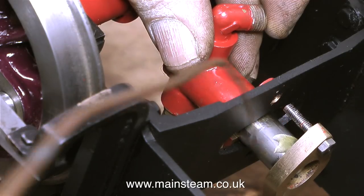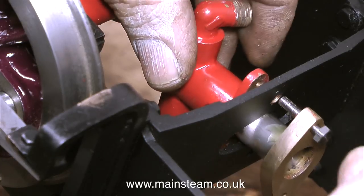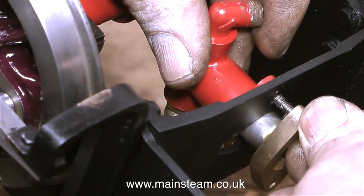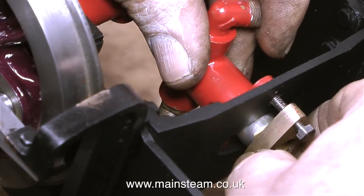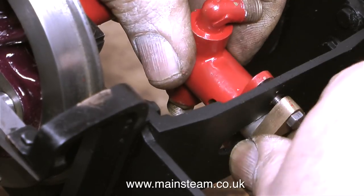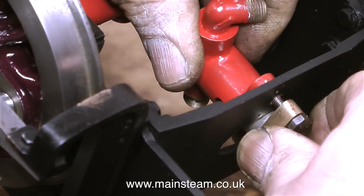In this clip I'm lubricating the ram of the axle-driven pump and bolting it into position on the stretcher between the frames. Being wise after the event, what I should have done is mounted the pump between the frames with the pump and eccentric fully assembled, and then put the axle in — but no, I did it the hard way.